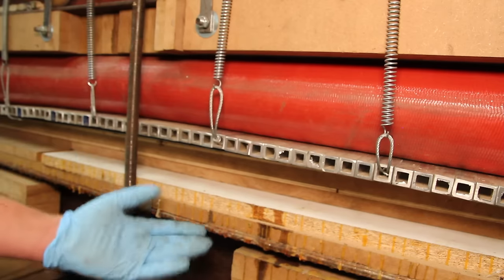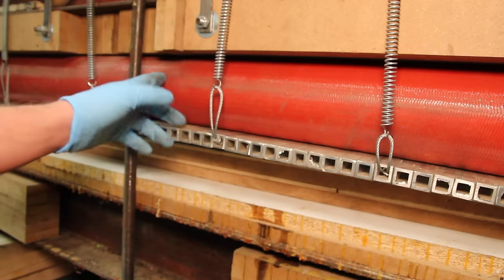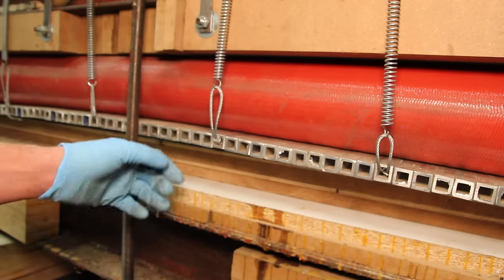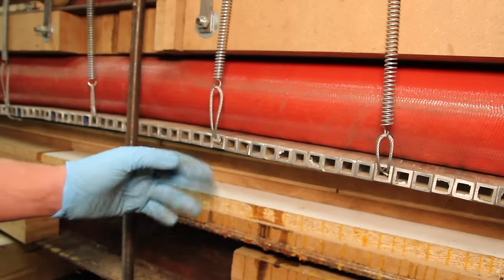Naturally, my ski press is made out of some rusty I-beams we pulled out of the edge of a field. We originally had smaller fire hose for the bladders, but someone in one of the snowboard building groups on Facebook was giving these away, so I picked those up. The molds that set the rocker and camber on the skis are made out of MDF and whatever plywood I have laying around, just CNC'd to shape.